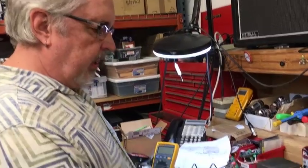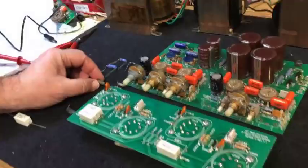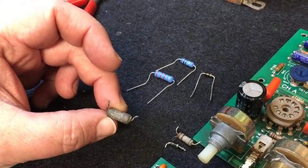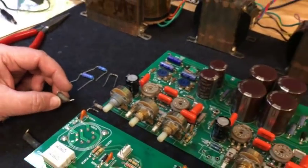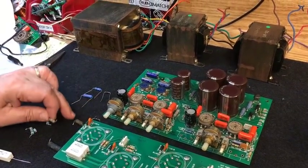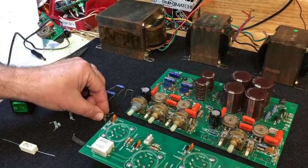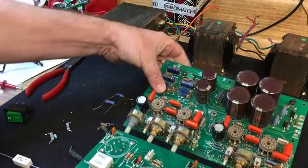The circuit boards have been cleaned up and for the most part they're in really good shape. Some of the parts used in a previous field repair are not the right parts, and they're partly responsible for why we saw some burned spots on the circuit board. They got too hot because they were the wrong value and are being replaced. Because this one was the wrong value, this one burned — and because that one burned, this one got too much stress on it. All of that heat came off these parts not as a result of the fire, but as a result of poor operation, causing the circuit board to burn.